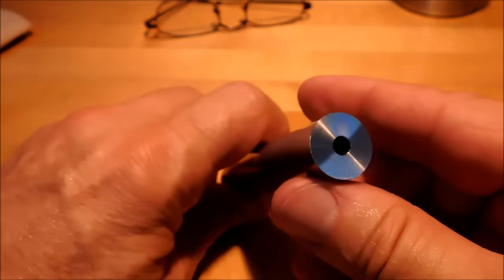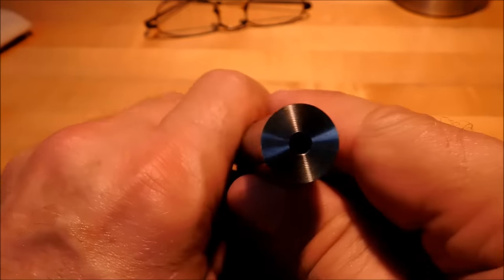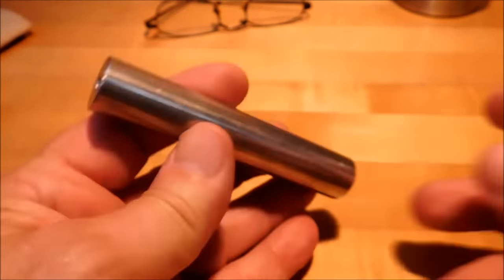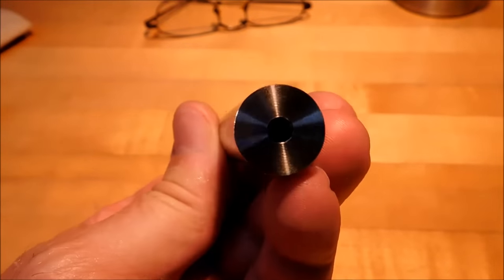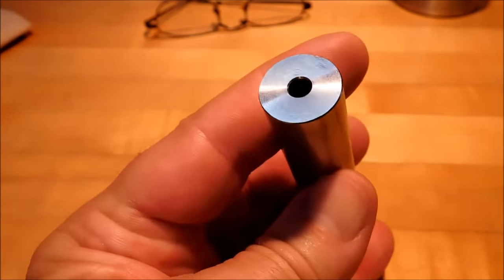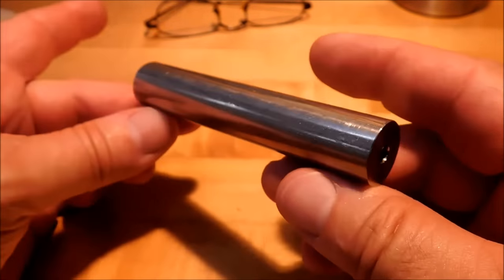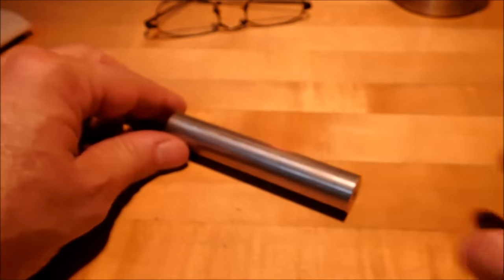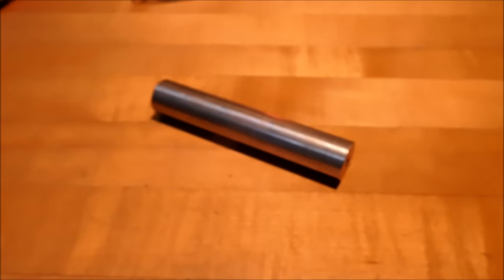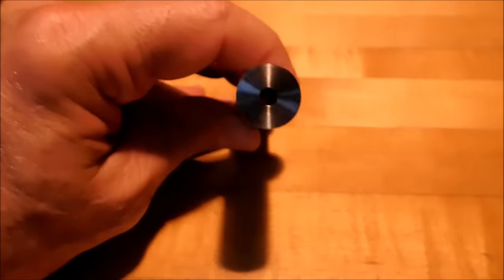There you go. You want to do it, do it the way I showed you. Try it. That was real time. I can't say I didn't take anything out. I may have. I didn't edit this yet. But I certainly didn't run that whole thing in real time, because you'd sit there and your eyes would bleed waiting for it to happen. But don't forget about unlocking the entire tailstock. Pull the tailstock out. Bore the lead for the reamer. Ream the hole and then start the drill. And don't be afraid to ream it as you go. You will have great success.